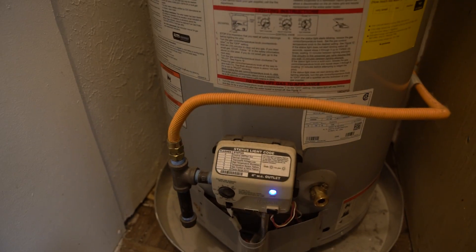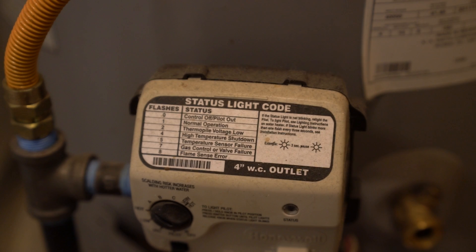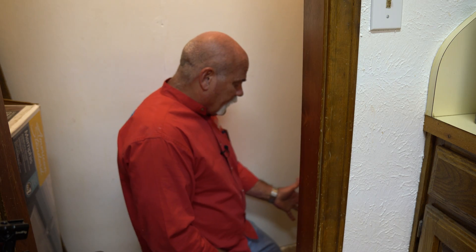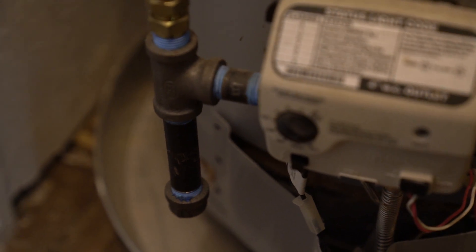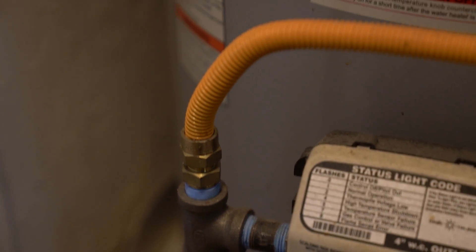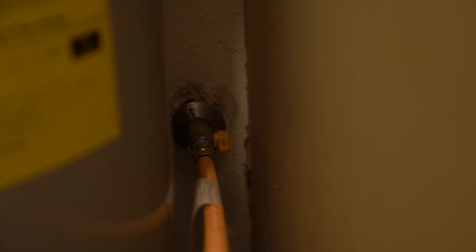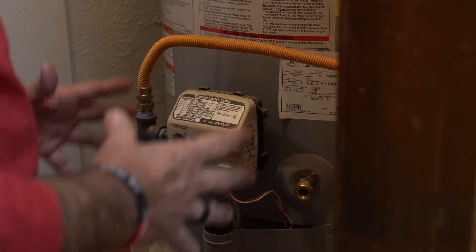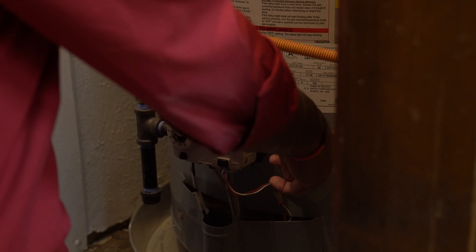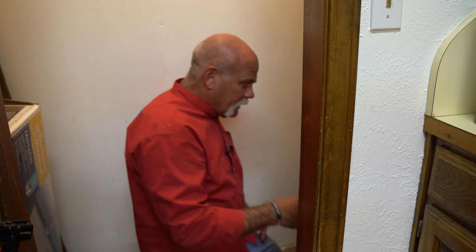Looking at this, we've got the gas control valve right here and it's a slow, steady blink — blinking one time — which says normal operation. It's not blinking seven or eight times and then going out. There's a drip leg installed, which is a great thing. They've got a little bit smaller flex on here than I like to use, but it's got a good gas valve — one that has a little yellow handle that you could just rotate by hand. My favorite thing about it is it's got a brass drain valve, not one of those plastic drain valves. So I could literally hook a hose up to it right here, take a screwdriver, turn that valve 90 degrees by rotating that screw head and getting it lined up with the flow of water.